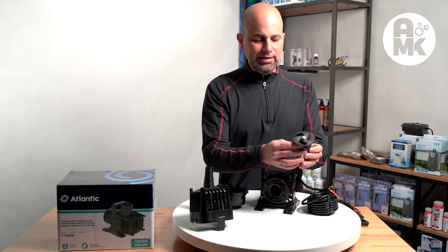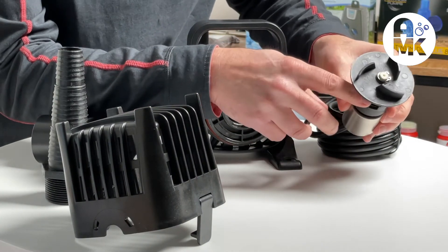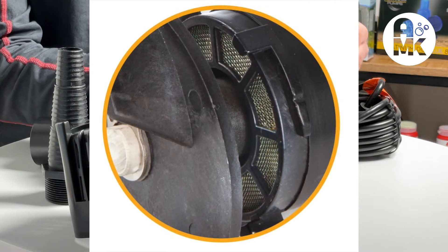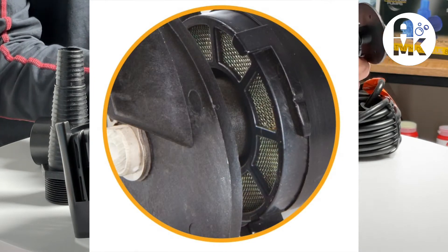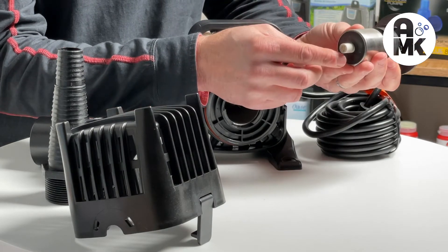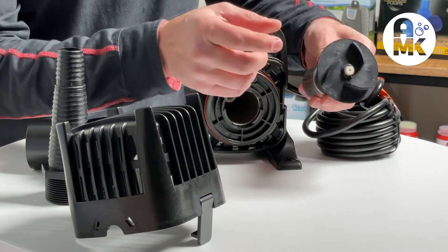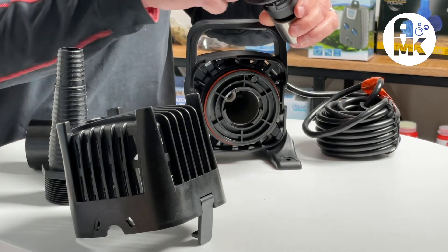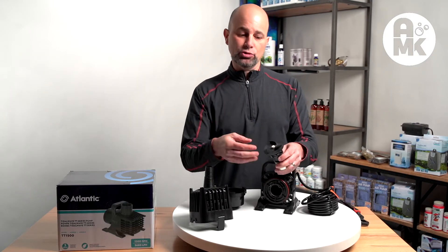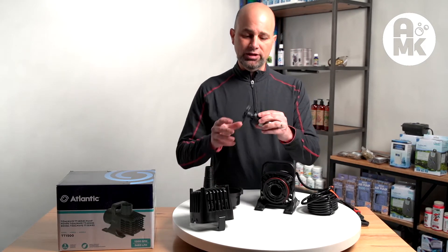Once you turn the tabs, you have a very unique filter sieve in here. It's a stainless steel screen that allows water to get back and lubricate, but does not allow big debris to get in and damage that stainless steel housing. It has a very large stainless steel encased rotor and a very large ceramic shaft. It uses a lock front so you don't ever have to worry about that reaming out. It's a wide open impeller design that lets debris just be purged through it — so it's not going to clog; big chunky stuff is going to go in and purge out the other side.